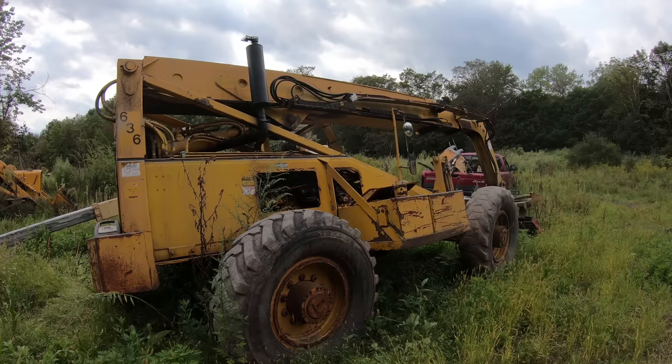And you can do that with these because these are boss bushings here, which means that it doesn't move inside of those. So that doesn't see any action. The action is all right here. The cylinder pivots on the pin right here. So that's the one that actually moves back and forth. This one is stationary and it has a bolt in it to make sure it's stationary. So as long as you get it pretty tight, it's good to go. It never gets greased or anything.